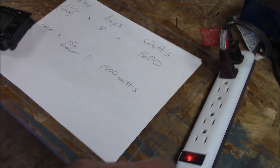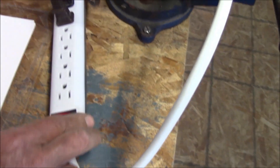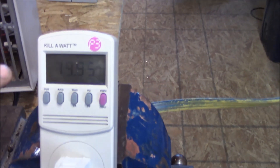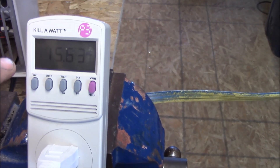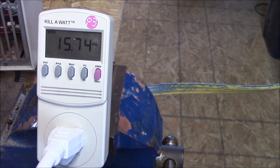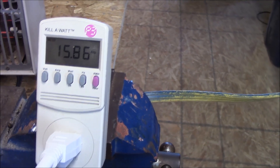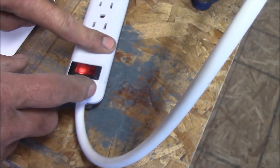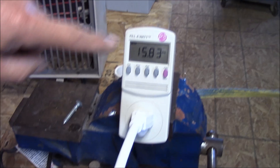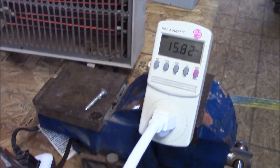We're also going to show a little product safety, because a lot of these power strips have breakers in them that are supposed to trip at 15 amps or 1800 watts. I'm going to bring another heater online here. This tool is beeping because we're over 15 amps. We're in my shop — I have a 20-amp circuit — but notice our little power strip did not trip the breaker. Here are my two appliances over my 15 amps. My house wiring in the wall could be getting warm. So with two heaters online, we can generate up to 20 amps worth of load.